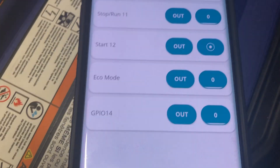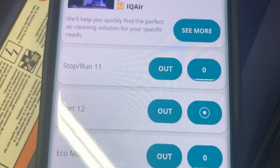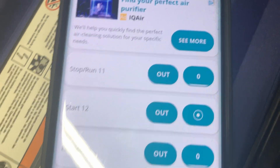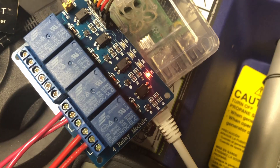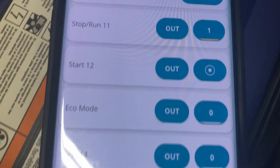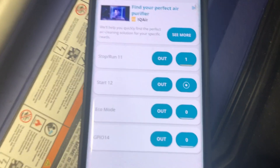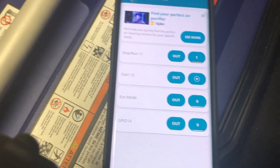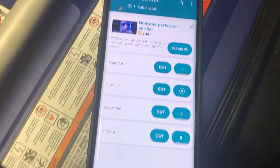The first relay will enable turning on the run mode — I'm going to press that. That turned on the red light there, so the generator now thinks that large black switch is switched. The second one is the start button. It's the first time I've tried this since I got the propane connected, so I'm going to press this and it's going to do a momentary pulse to trigger starting the generator — so we're going to give it a shot.